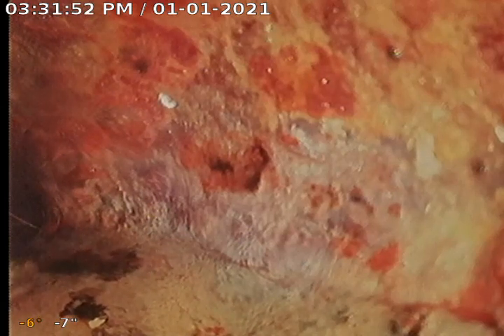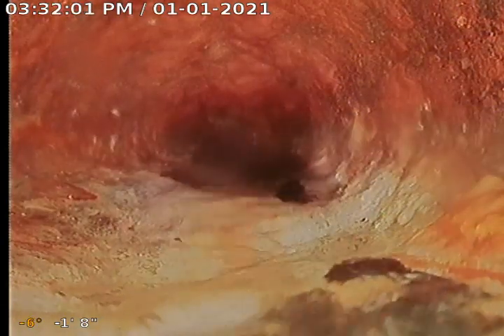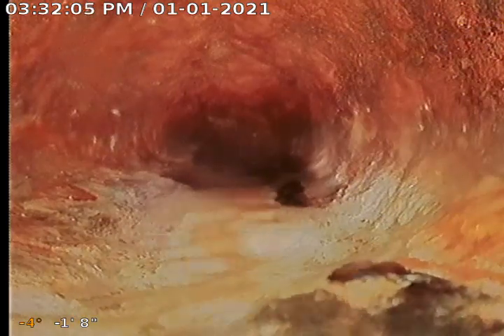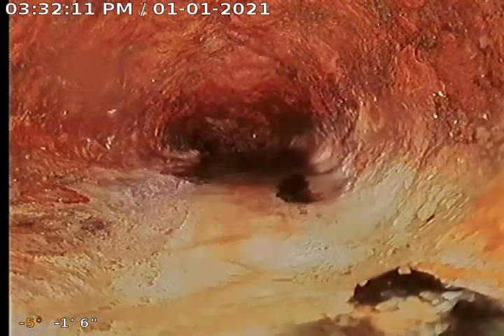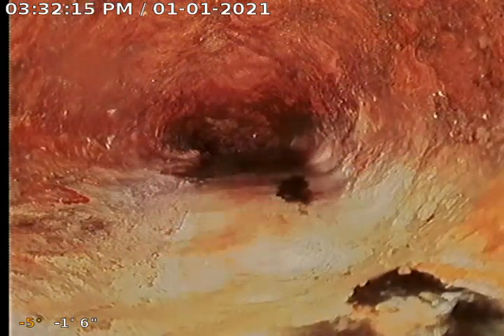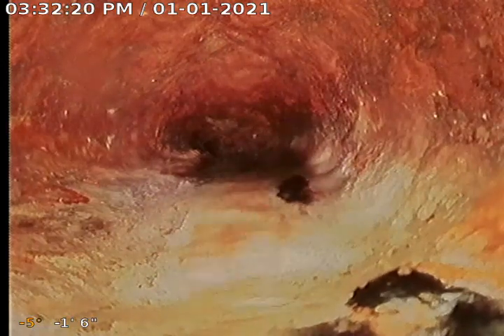This is the master bathroom that we'll be pulling back across the length of the house from one side to the other. We ran a little bit of water again just to clean off our camera lens. As soon as we back up on the line right here, you can see that this pipe does not appear to be nice and circular round like the first cast-iron we just showed. This is kind of ovalized. There's a lot of scale and buildup and deposits on all the walls of the pipe, and that's why it looks constricted.